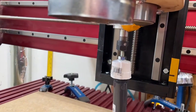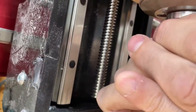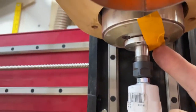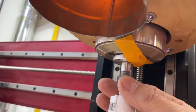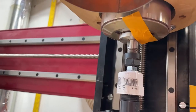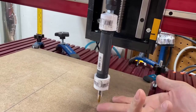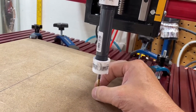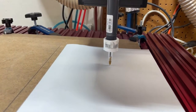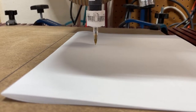Now let's go over to the CNC machine. This will get mounted because that's a quarter inch collet that's mounted in there, and I'll secure it so that it's snug and can't fall out. I've taken a bit of orange tape and put it on the spindle because I don't want this to turn — if I tape it down so that it doesn't turn, that makes it more secure since the pen should not spin. So everything is secure except for the Z-axis, which has a little spring to it, giving just a little bit of compression.